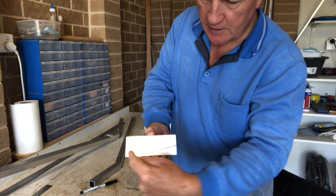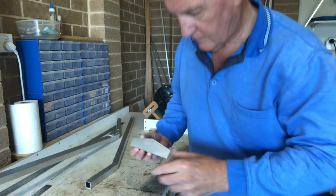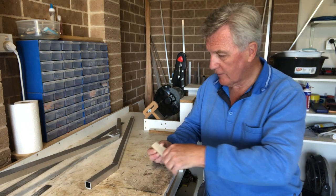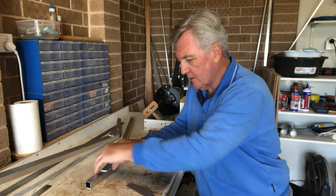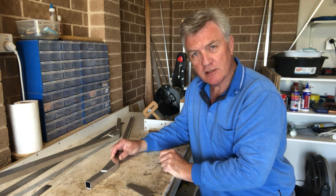There's my line, so I'm just going to cut off this bottom section. I'm going to do it on both plates at the same time. And there we are — all I've got to do now is just offer these up to the handle and use pop rivets to hold them in place.